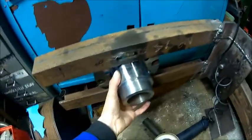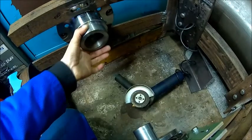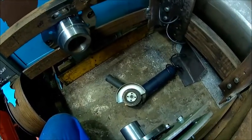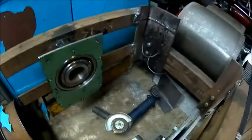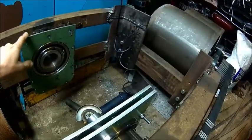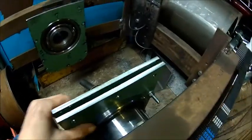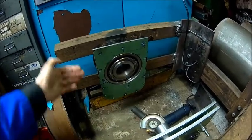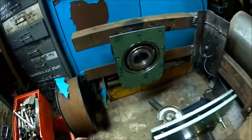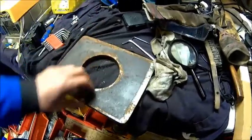So that's how it fits — I had to grind out a little bit, it was not enough. The same thing goes on this side: bearing and that trunnion here. We need to make some retainers here, so we just mocked it up. That's how it goes — there's only one plate on this side because the forces are less on this end. We need to make some clamps so it doesn't move, and a retainer which is also a cover for the bearing. We found a piece of scrap here which probably fits — it's flame cut but we'll make it fit.